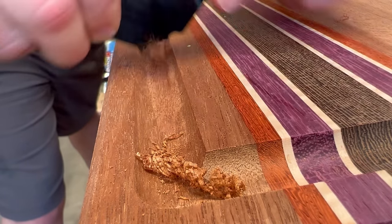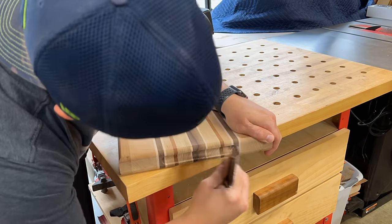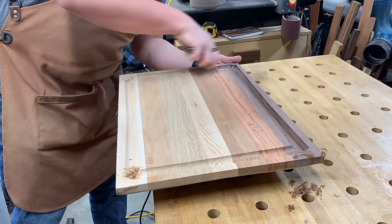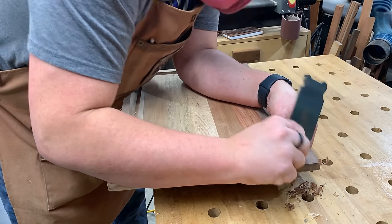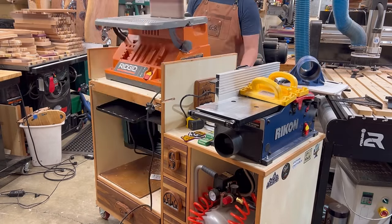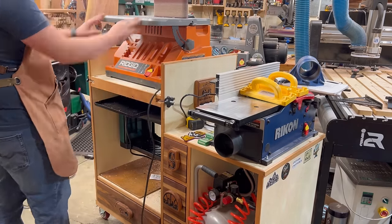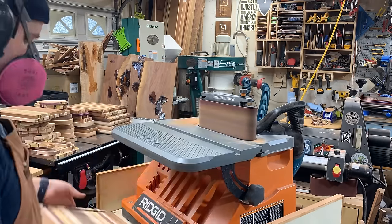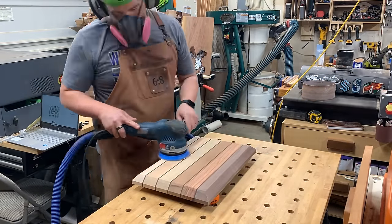A big tip: use a juice groove scraper. When making 3/4-inch juice grooves, if you mess one up or get burn marks, instead of sanding you can use this scraper — the burr on the edge cuts it away and saves a ton of time. Some woods like cherry and ash burn easier, so something to consider. Another tip: a flip-top cart is great to have multiple tools in one space when working out of a garage. A benchtop disc/belt sander is really helpful for quickly cleaning up edges, especially end grain.